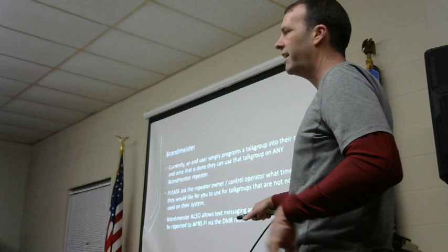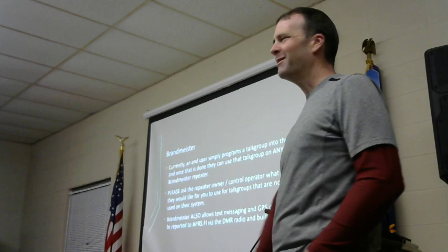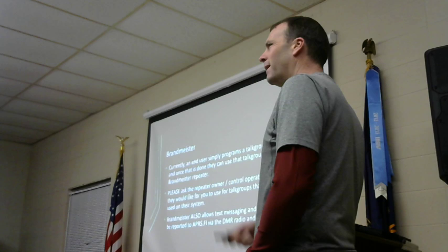But that's the benefit of Brandmeister, you don't have to worry about that. Just be aware, once you get it set up, you will probably get emails from people traveling through saying, hey, I want to use your repeater in Springfield. Can I use talk group XYZ? And you're going to say yes or no. And if you say yes, just please specify time slot 1 or time slot 2.